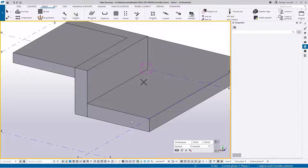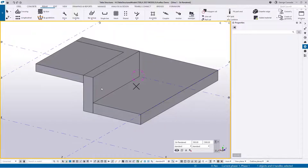I've modeled it this way because if I had to model concrete from scratch, this is the way I would do it. It just makes for easy reinforcement detailing if your target is to reinforce. If not, you might want to do it the other way. There's also the possibility that if you've imported this from an IFC, it would be the other way, and then you'll have to reverse the process I'm going to show.